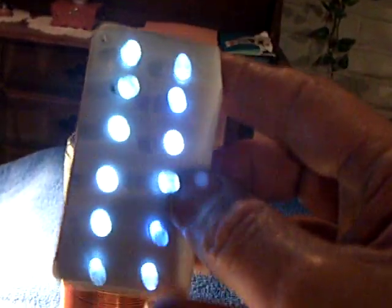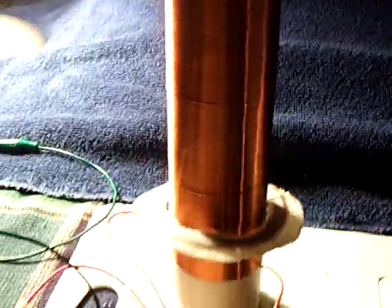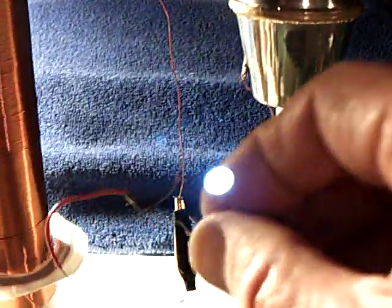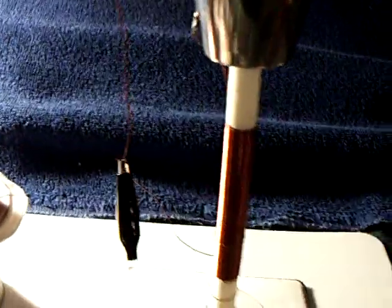It'll light up more. The thing is running on a volt and a half or less, and it's still putting out this high voltage. I thought that was very interesting that you could make one of these exciter circuits work on that kind of voltage and get it to transmit wirelessly quite a ways away.